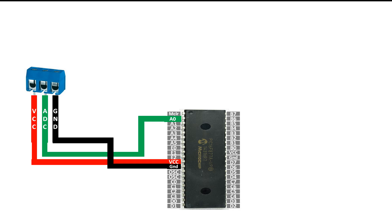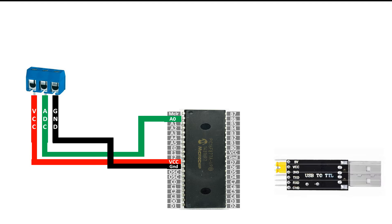For the output you can use an LCD, OLED, or a touchscreen, but in this tutorial I will use a USB-to-TTL device and send data to a serial monitor on a computer or laptop. You can also connect this device to a mobile phone using an OTG cable and a terminal app. The USB-to-TTL device — a CH340 — has six pins: 5V VCC, 3.3V, TX, RX, and ground. You can also use the FT232 or CP2102. Whichever USB-to-TTL device you have, they always share three pins in common: TX, RX, and ground.